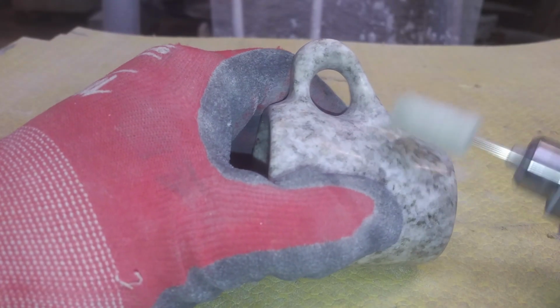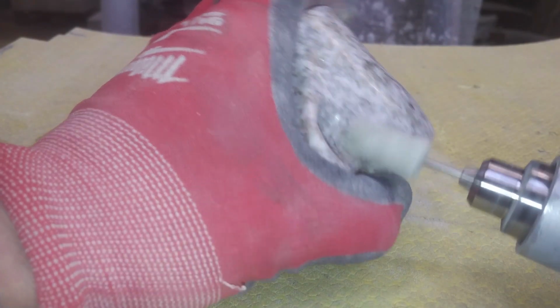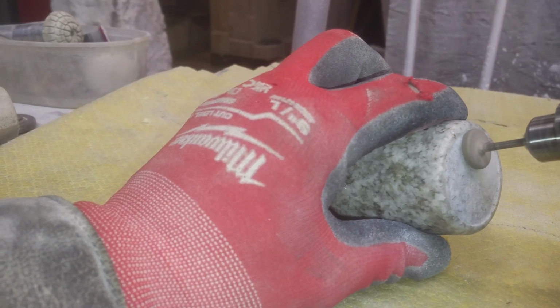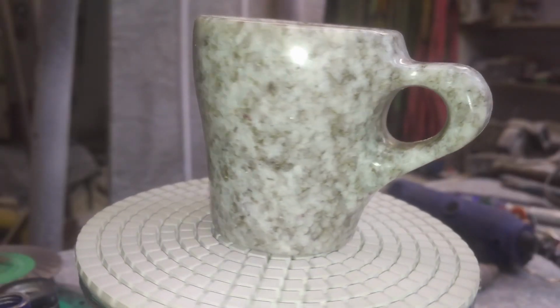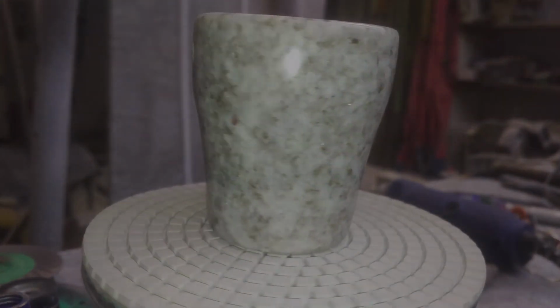Angle grinders. Two kinds of them. First one, let's call it professional. And the second one is just a regular angle grinder with variable speeds. The main difference is this one has a coolant supply through the spindle, and you will never achieve the same quality of polishing without cooling. And also it has much less RPM with much more torque.